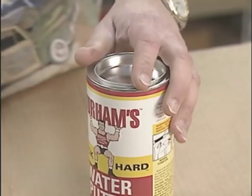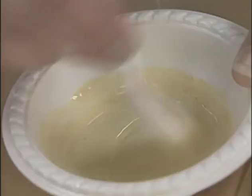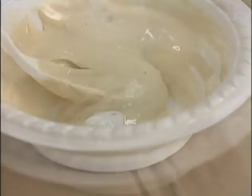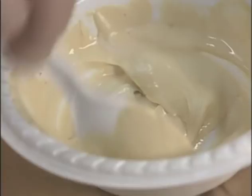One of my favorites, and one of the cheaper ones, is a gypsum-based powder that comes ready to mix. Since it's a dry powder, it has an indefinite shelf life and will never go hard in the container. Spoon some into a container and mix it with clean water to a fairly thick paste. If it gets too thin, add more powder; too thick, add a few more drops of water. Stir it well until it's smooth with no lumps. As putties go, this one is particularly brittle, so I'm going to stir a dollop of white glue into the mix to make it a bit more flexible and tougher.